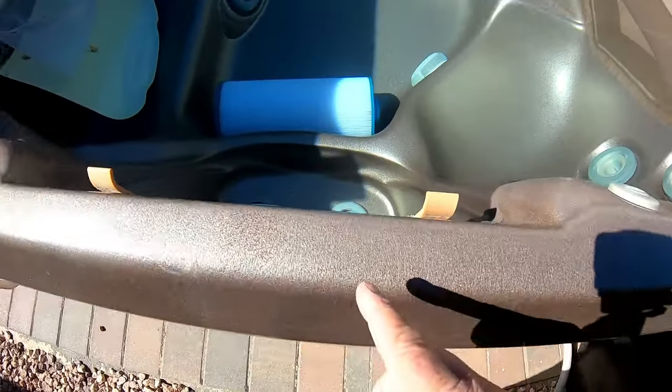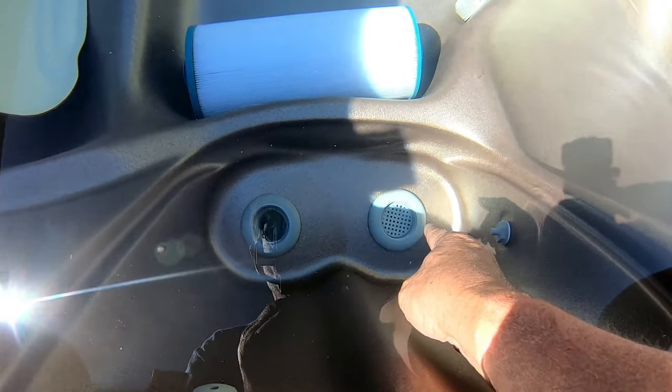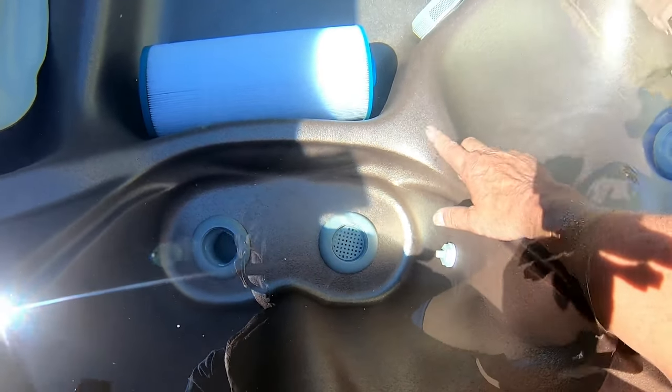Probably the bearings. When you look into the tub on this one, it's got a screen on one side and the other side is open — there's no screen. It's drawing the water from there into the circulation pump into the heater, which it's not doing. This little gray thing on the side is the heat sensor; we'll be changing that also. So we're going to start removing everything, get all the water out of the hot tub, and I'll show you how I go about doing this repair.